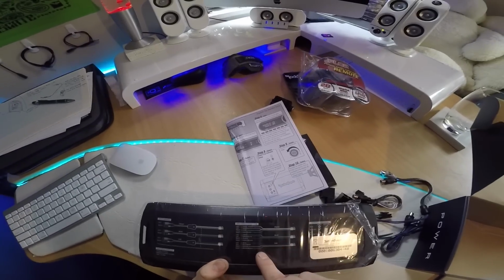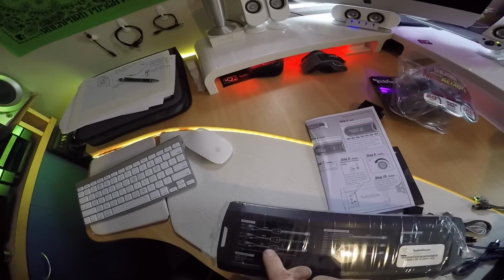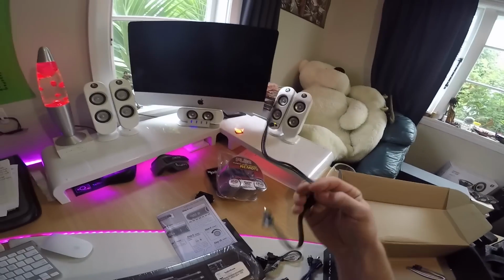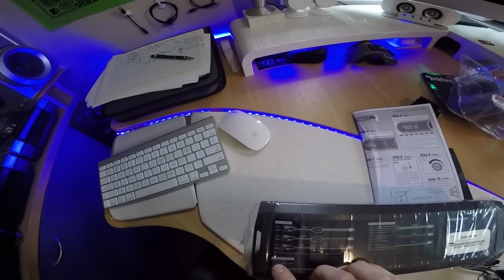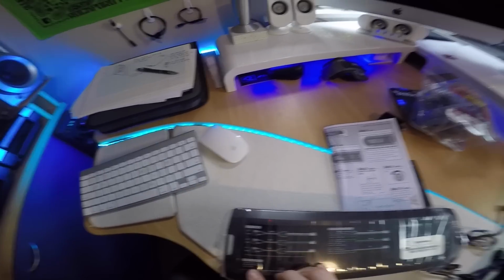So you've got your speaker outputs here, and then these are the RCA adapters, a picture of them, and they say cut here if using a high level input. Like I said, you can cut off these bits entirely and just solder wires on. And then it's got impedance stability down here, so you don't ever go wrong with it. Stereo 2 ohms minimum, bridged or mono 4 ohms minimum, and subwoofer 1 ohm minimum.